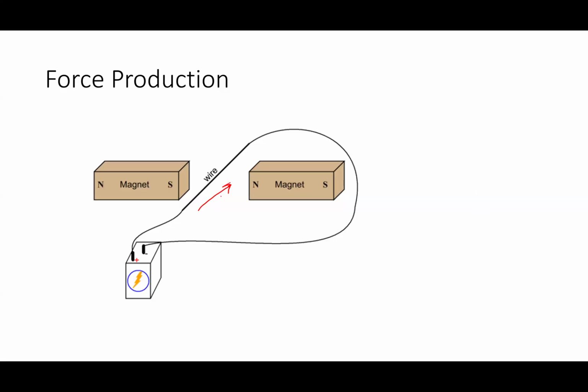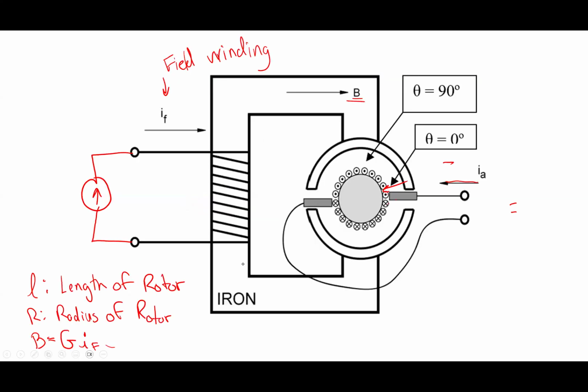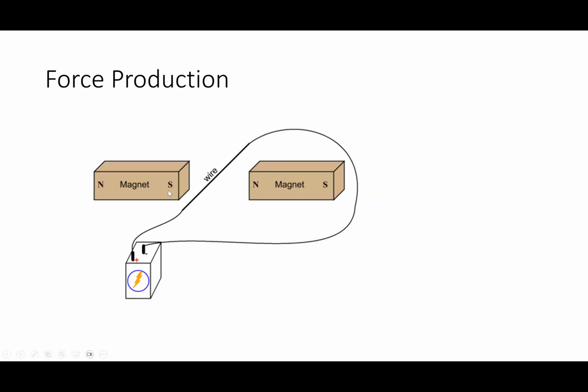In the motor, I had a DC field that was created by these magnets. So real quick, north to south, which way does the North Pole, South Pole, which way is the field going? Well, all right, you guys are doing it for the wire, right? But if I have two magnets here, the field goes basically from the north to the south, right?